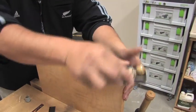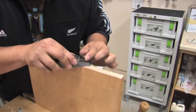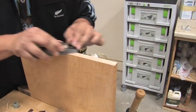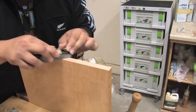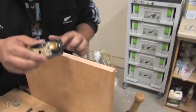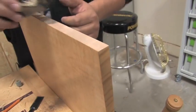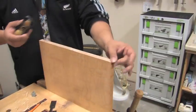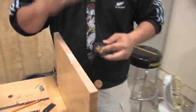That's a lot of end grain. It's fine, I didn't pick the best board for this. Maybe we'll just focus on this side over here. You'll notice there's no real chip-out on that edge, and we are planing pretty aggressively. The farther you go down, you've got to come back and chamfer that a little bit more if you need to plane some more, and then keep going.